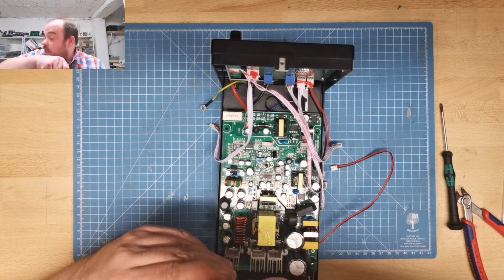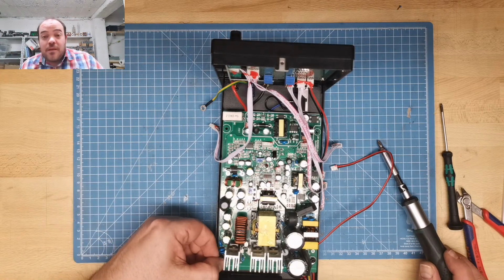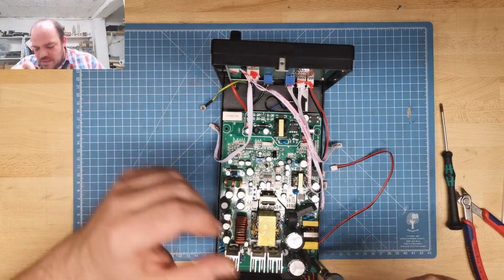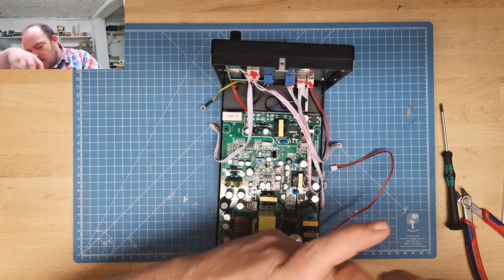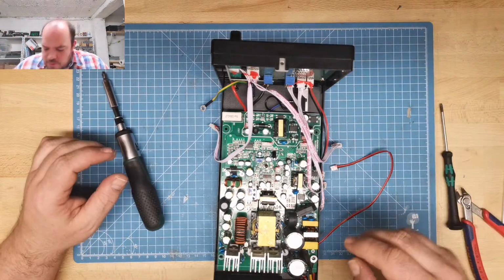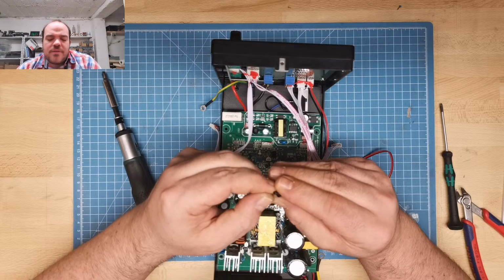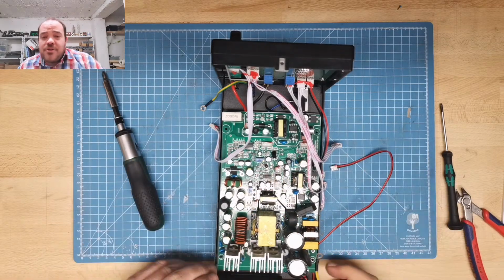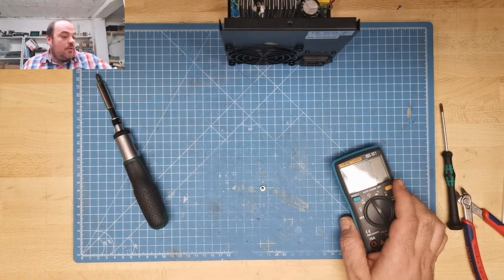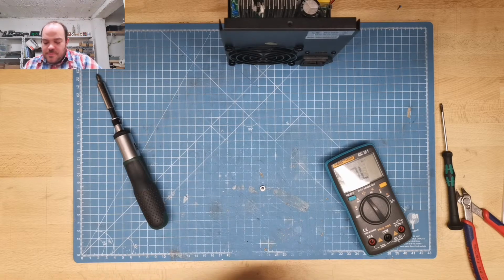Now we come into the area with the high voltage. Remember, I'm here in Germany. We have 240. Today it was about 240. Not the best voltage to touch. And there's the other earth connection. Also an earth connection. I'm not sure about the black screws, but I think, let me check this. I'm just guessing, whatever. They're not so conductive, and without the star washer, it's not the best.